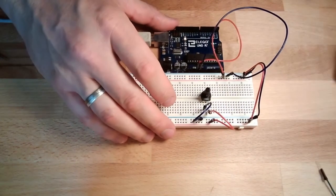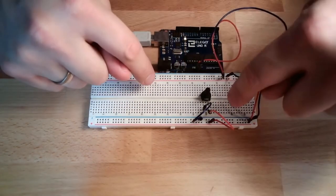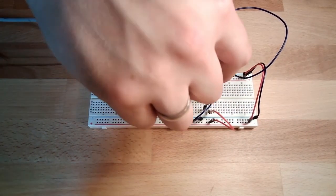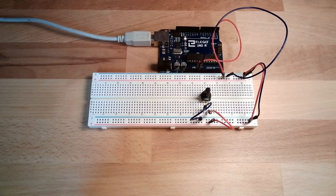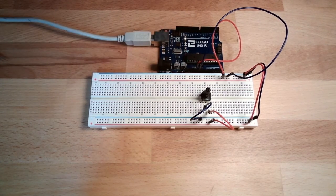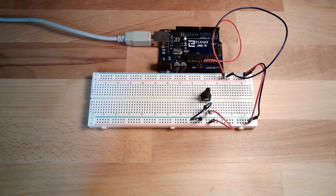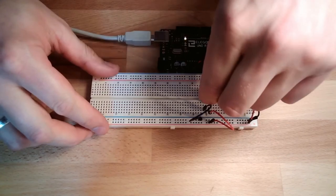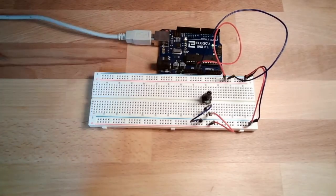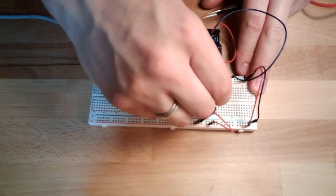This one we will use to test our analog input. So one end plus, second end minus. In between, we do not have, like before, 3 kilo ohms, we have 10 kilo ohms, that is why it's written on the 10K. And here is the so-called sliding contact. We can select where we want to have the sliding contact, here on this side, or we can turn it over to this side.